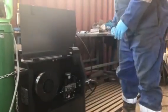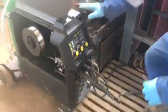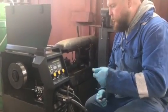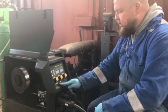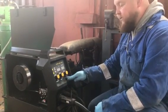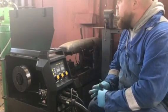Looking at the front of the machine, it's quite a basic setup. We've got 2 and 4 which we can adjust depending on whether you want on/off the trigger or latch. We can adjust the inductance, and we've got our voltage gauge and our current and wire feed, which obviously link. So it's quite a basic setup in terms of the machine we're going to be using.